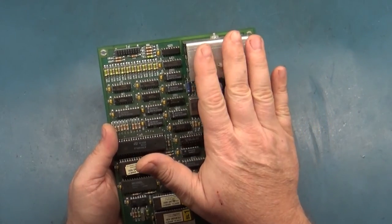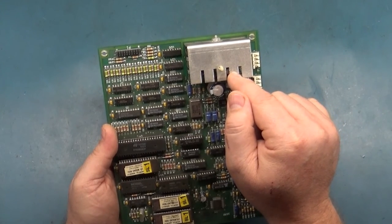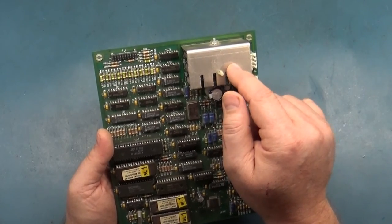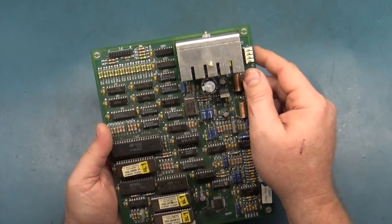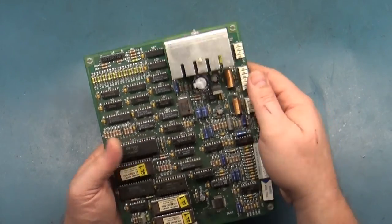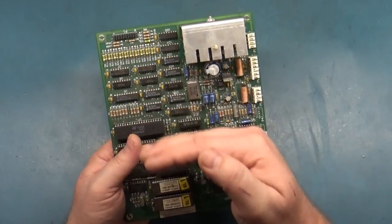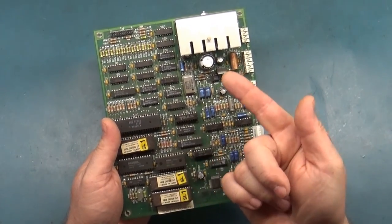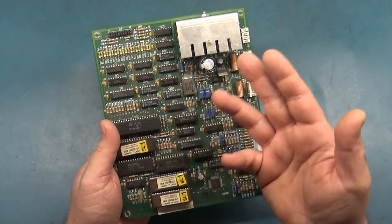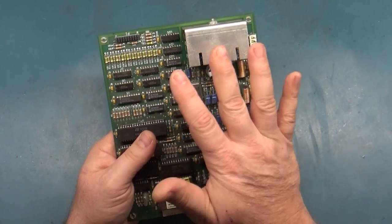If you have one that is scalding hot, then the amplifier is being way overdriven, and you're shortening its lifespan exponentially every second that it's running. So I opened it up and touched the heatsink, and it was scalding hot. So I shut the machine off and took out the soundboard, and we know that we have functional logic because we have the correct audio, the correct sounds, and the correct music, but the sound effects are scratchy and low volume. But the music was correct volume.